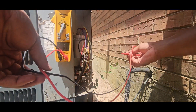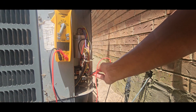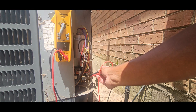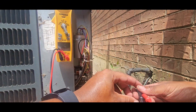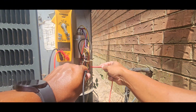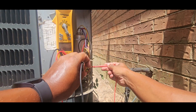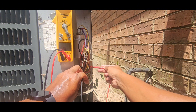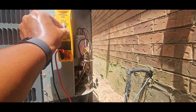Alright, so first thing I'm going to check is across the contactor on the bottom. That gives me zero. I don't know if you guys could see it when I took the cover off the disconnect, but there are fuses there, so one of those fuses could be blown — they could be both blown. What I want to do next is see if anything's grounded — any of these legs are grounded on the top side of the contactor, to see maybe if the compressor grounded out or something. Nothing on that leg, nothing on that leg. That lets me know we should be fine.